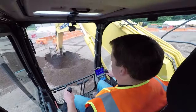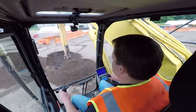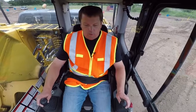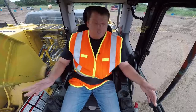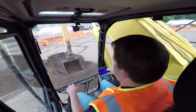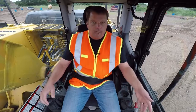Depending on grade, you always start at max reach and work toward your tracks within a few feet. That's the time where you back up and start all over again. Obviously look where you're going backwards — you've got mirrors on the machine. That is the basic dig controls. To park it, generally just put your bucket flat to the ground — if you leave the bucket up, it can settle. Then put the lock lever down.